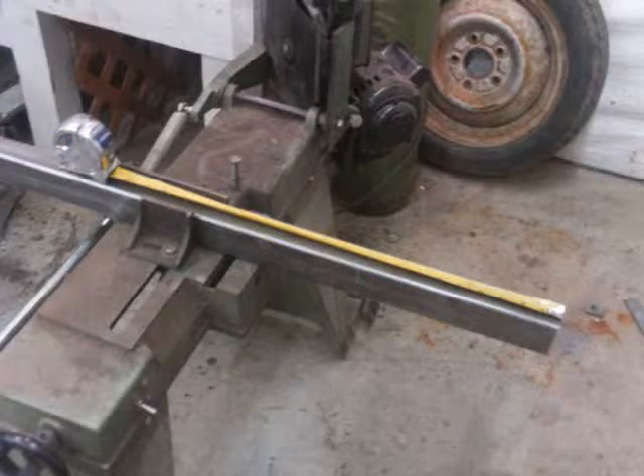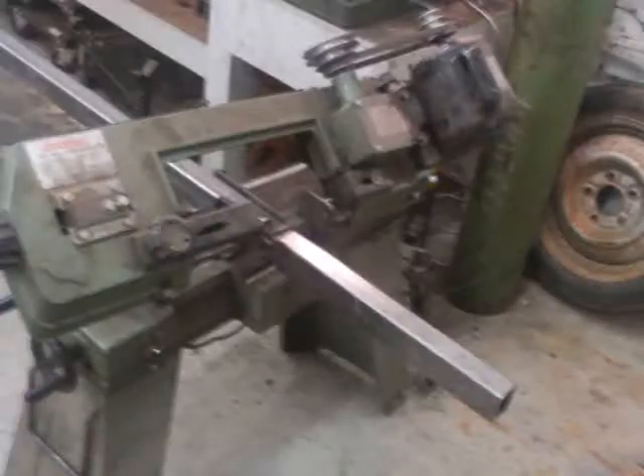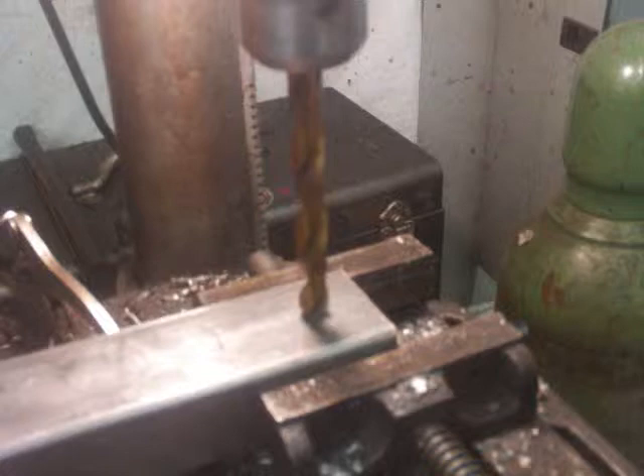I started with some good boxed steel, got it all measured out and cut to length, then drilled holes exactly where the bushings need to go. I took a little piece of round pipe and circled that so I could cut it out with a plasma cutter, making it big enough for the pipe to fit in. I got that cut out — it's a rough cut, but just a little work with the burr and it cleans right up.